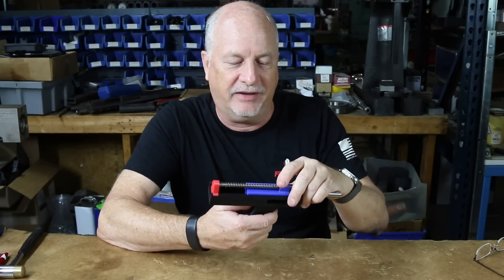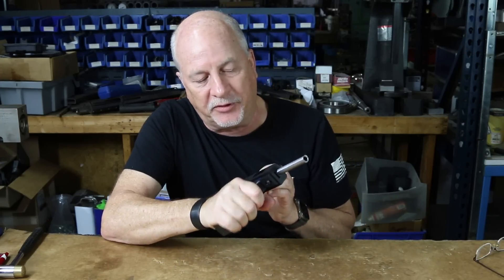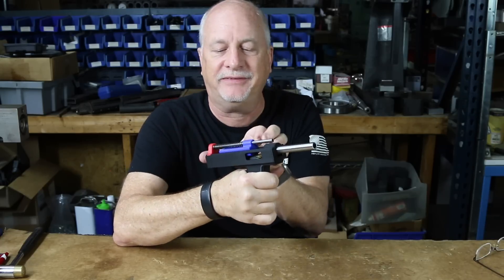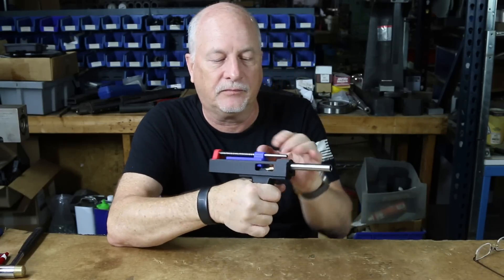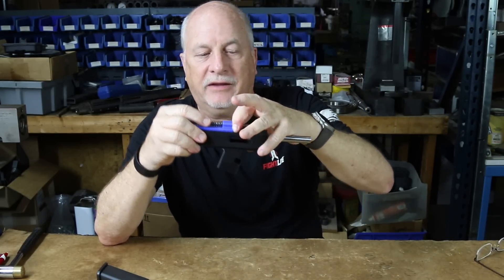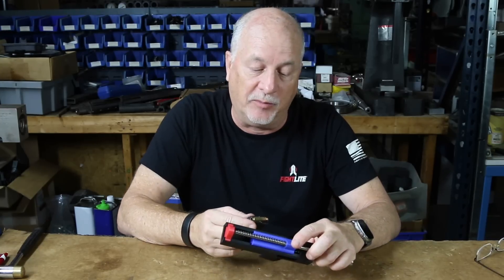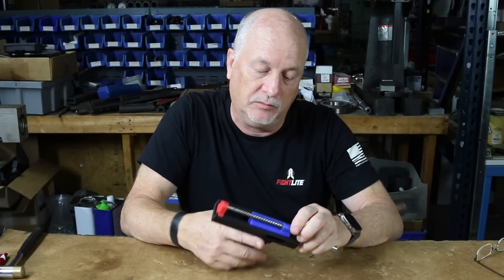You don't know. You'd think there'd be a scientific way to do this instead of trial and error, and there kind of sort of is, but this is a simple and actually pretty quick way to do it. So let's try again — I'll put the mag down farther. This doesn't have enough strength; let's just push it. The mag or the round made it in there, but as we're going to see on high speed video, it was probably not an optimal angle. You don't want your round having to go way up at a huge angle — you want it as straight as it can be, pointed at the chamber mouth.